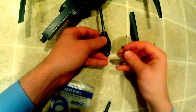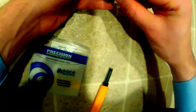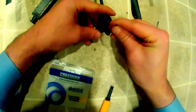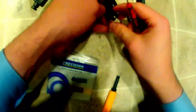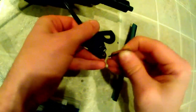To get the bushings out, the easy way is to stick the shaft back in partway and then rock it in a circular motion and it'll come out. For the far side, you can put the shaft in at a little bit of an angle and try to drive it through, or flip it over and copy the same wiggling motion.